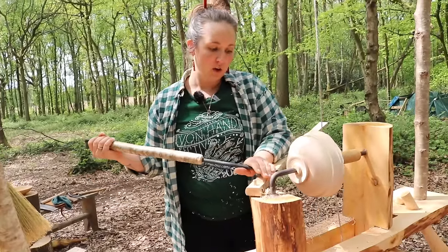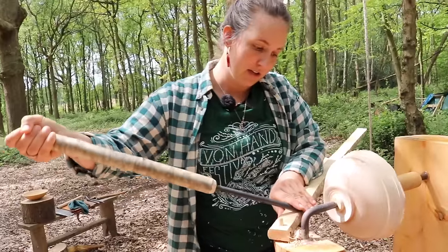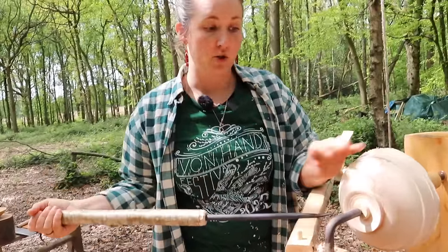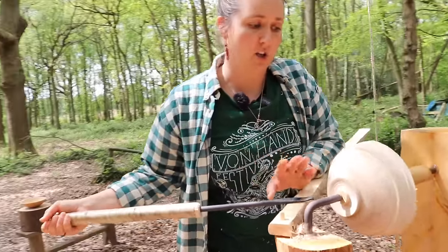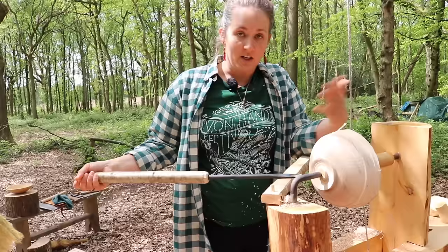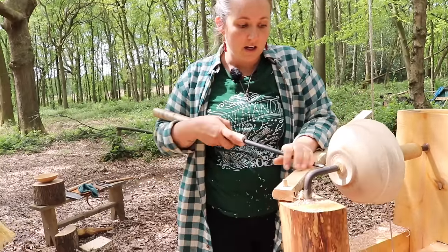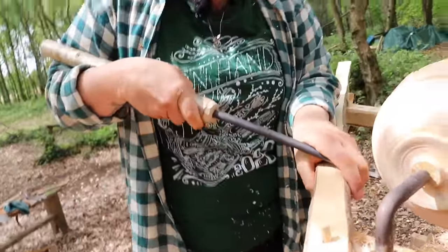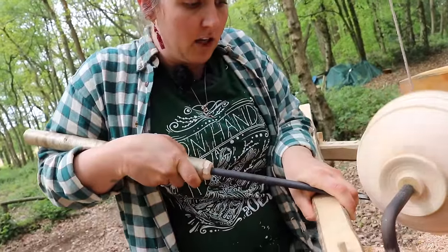And so if you sweep the tool down slightly as you're mimicking the roundness of the bowl, you're less likely to have that happen. That was very normal for a lot of my bowls for a long time. And why I mention it now is you can use that intentionally for a decorative feature. So if you want a little bit of a dip here, I'm gonna get more of an anchor point and move through that anchor point to make that arc intentionally.